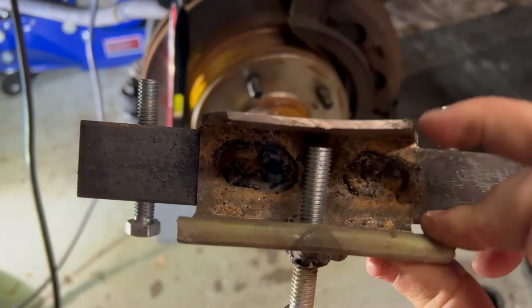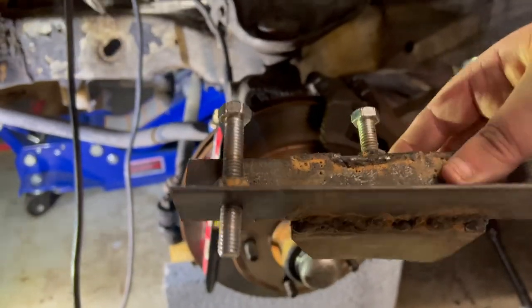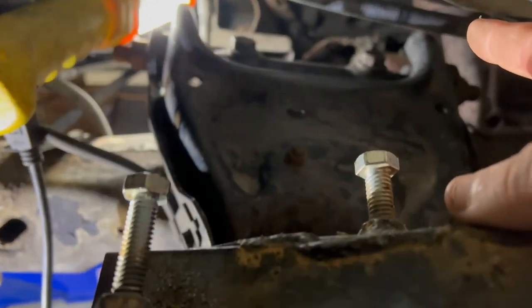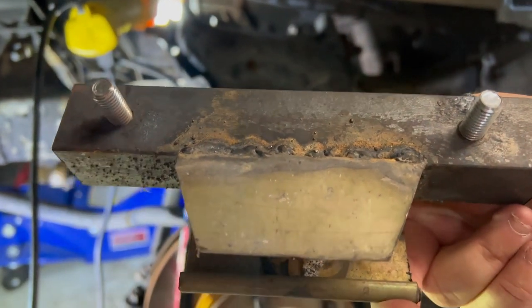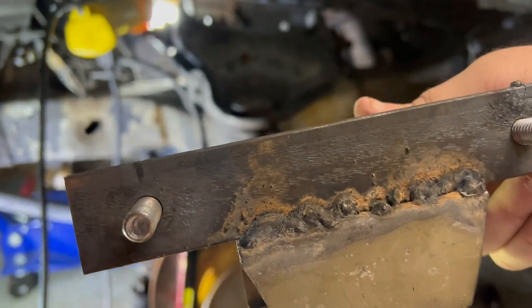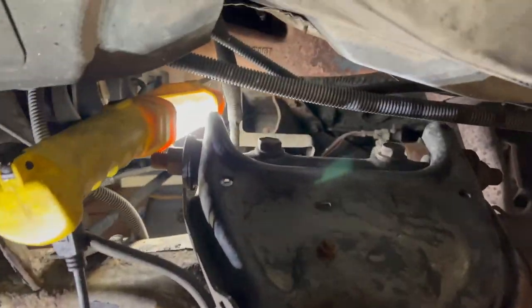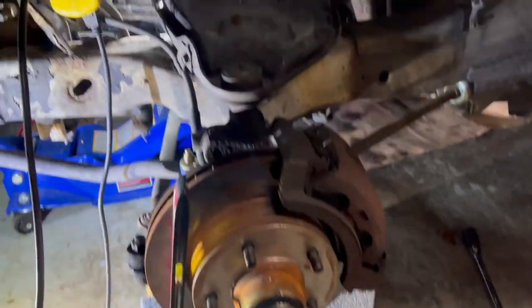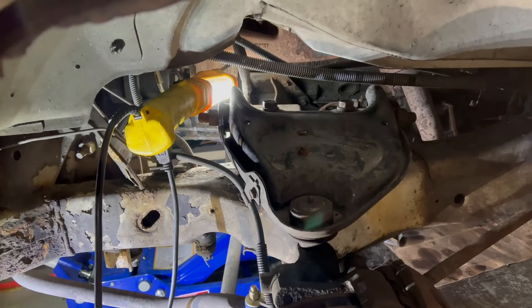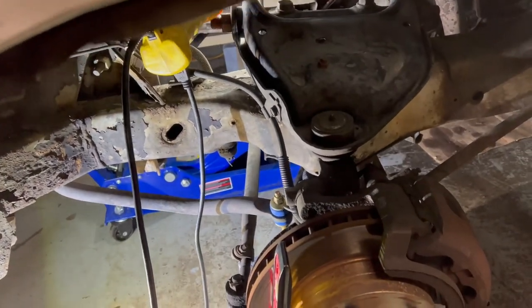Apparently I didn't take into consideration the force required to make a camber adjustment. So I gave up. But in the process, I found out that those two top camber adjustment bolts were too loose. I stuck this breaker bar on there and there was no effort at all to loosen them. So maybe the alignment shop did do the adjustment — he just didn't tighten them. That's a very important step: tighten those bolts after the alignment's done. Apparently, he didn't do it.